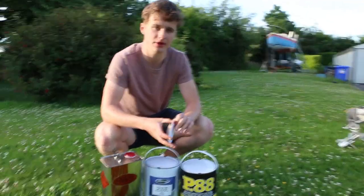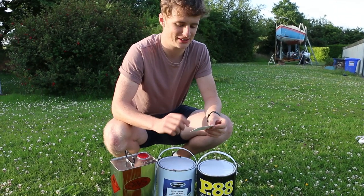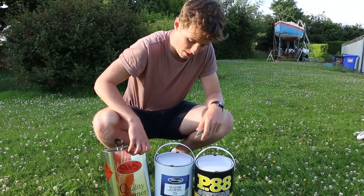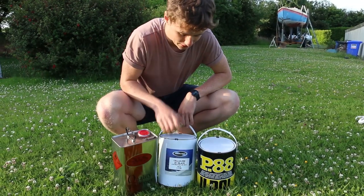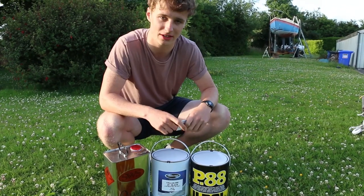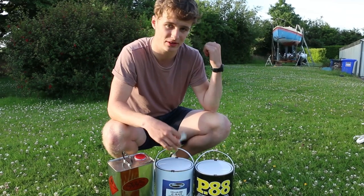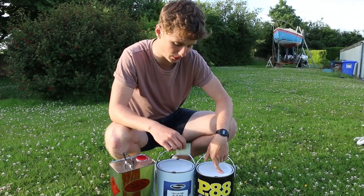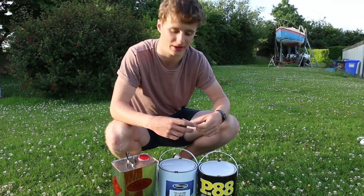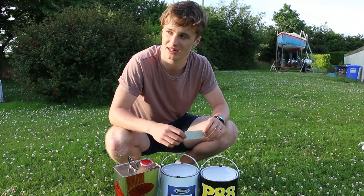Because it's far too expensive to go into a chandlery and buy marine paint, we've gone to a motor factors in Turners Cross, Cork, and picked up a big tin of thinner. This is our paint - black, because it was cheap. This is a high-build filler, so I'll antifoul the hull straight on and put filler above the waterline and paint it. The thinner will thin it down for when we're applying it. We're looking at spraying the boat in the next couple of days while the weather's nice.